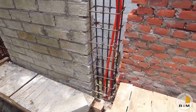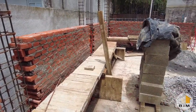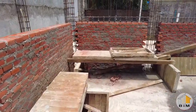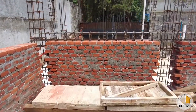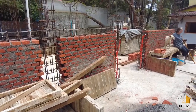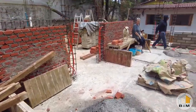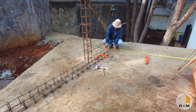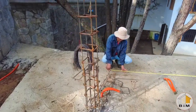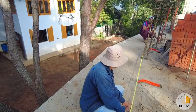On walls with a longer span, such as in the great room, every couple of meters there's an upright post, which they call a castillo. Additionally, because these are very high walls, 3 meters high, they'll be building a half wall with a rebar and cement cadena over the top of that, which creates a platform on which to build the top half of the wall. And in this corner of the house, since there's no rebar coming through the concrete floor, they need to build a trabe out of rebar and concrete to have a solid structure on which to mount the upright castillos.